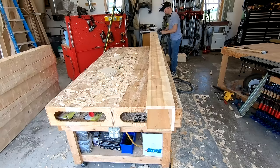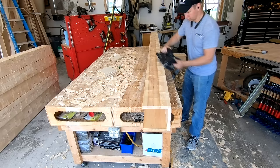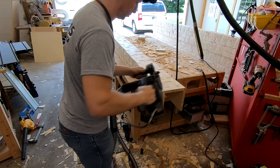One of the other reasons I like the Festool planer is it's the best tool for rounding over the corners a little bit and making it look like an actual barn beam. You don't want a super sharp corner, and the way I can hit those corners with this planer makes it go really fast and is much more effective than using a hand tool.